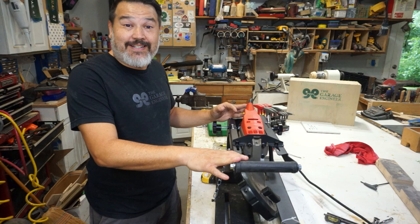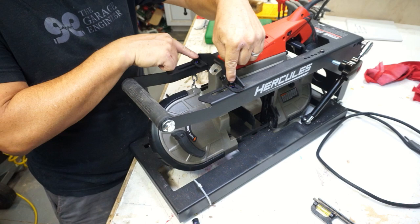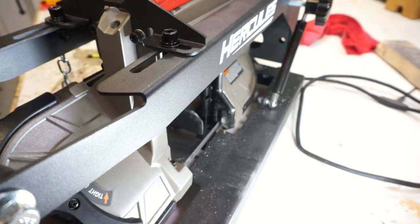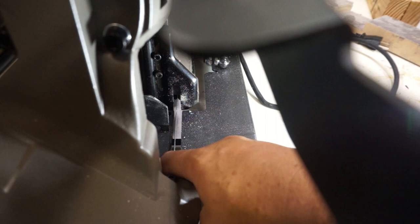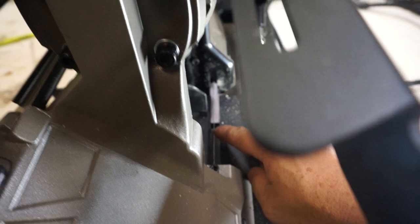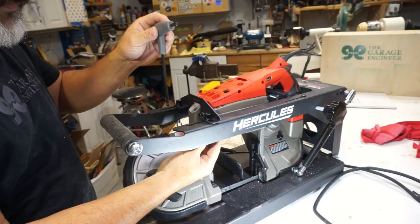Now let's check the calibration in the horizontal stand configuration since we didn't do that last time. When we mounted it we just screwed in the two bolts and put it on there — we weren't really concerned where it sat as long as it wasn't hitting the stand. But now we want to align it. The first adjustment we're going to make is up top here. You're basically looking at the blade between the gap, and you want to get the blade somewhat centered between the two. Then we'll get it square using the adjustment knobs on the back, which tilt and move the back of the saw to get the blade square to the fence.